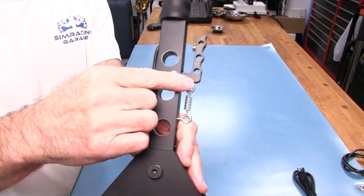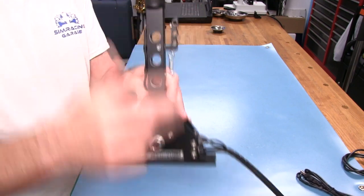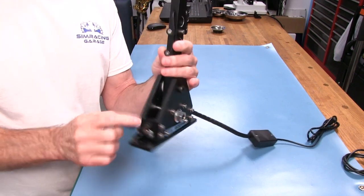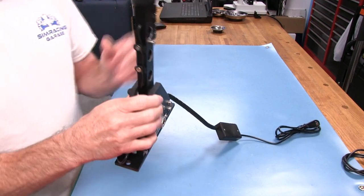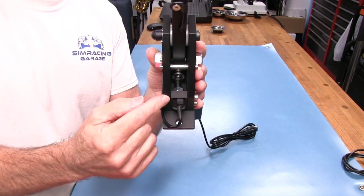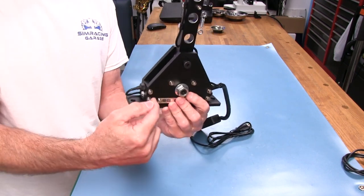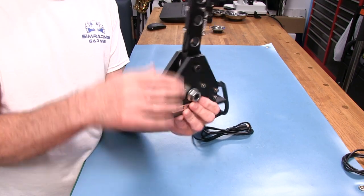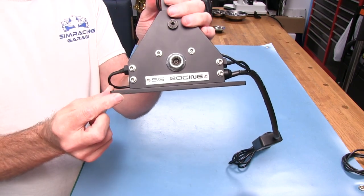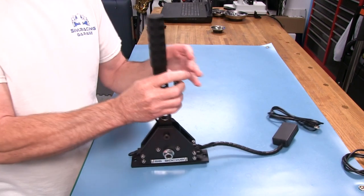The same styling details continue on the lever up here. The side plates are 8 millimeters thick on each side supporting all the internals. The end plates — I call them spreader plates — are 10 millimeters thick. All this is bolted together with stainless steel hardware. Everything is tapped for thread, so there are no nuts hanging on either side. The bottom plate itself is 6 millimeters thick and has M8 holes for mounting. Pretty simple to mount these.